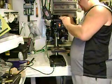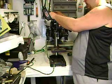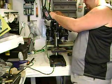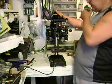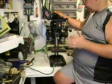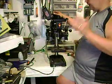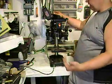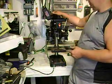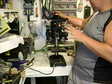Okay, and our speeds from the factory, we can go from 730 RPM, 1100 RPM, 1450, 2100, 3150. If you're going to drill steel at 730, use a lot of cutting fluid. I really don't like to see guys drill at 730. I don't even like to do it. That's why I have bigger machines that can drop down to like 300 RPM. But if you got to really drill steel, fine.